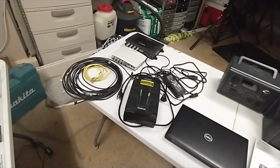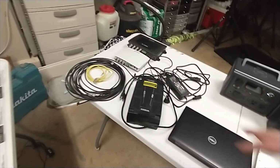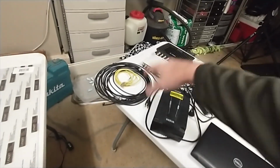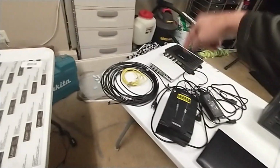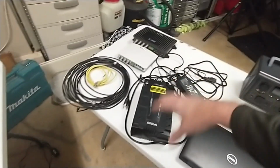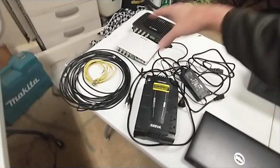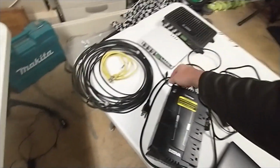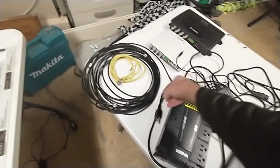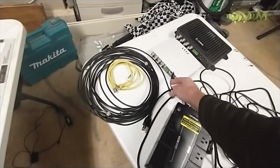The other thing is you have to worry about if you're training a new timer. There are a lot of connections here, right? You've got the antenna cables going into the reader, and then the Ethernet going from the reader to the laptop. You've got the power supply going to the reader, and the battery backup, and which side to use? Obviously, the battery side, not the surge side. Then what order do you connect things up? You want to make sure you hook this end into the reader first before you plug in the power supply to the reader, because if you plug in a hot power supply, it could shock the board.